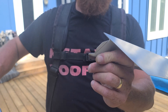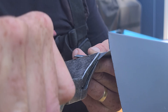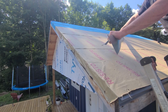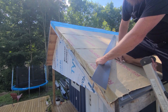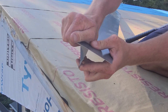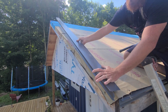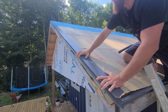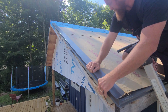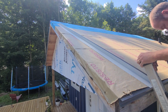Now for the moment you've been waiting for — get out your pair of folders, grab the 3/8 tab, and bend it at 90 degrees. Pro tip: for the miter to seat nicely against the opposing eave trim, I like to take some of the bend out of the mitered end of the gable trim. This little trick will tighten up your miter and make things look really nice and professional — something you'll be happy about every time you look up and admire your own work. Since this is a very highly visible miter, it's definitely something you'll want to consider doing.